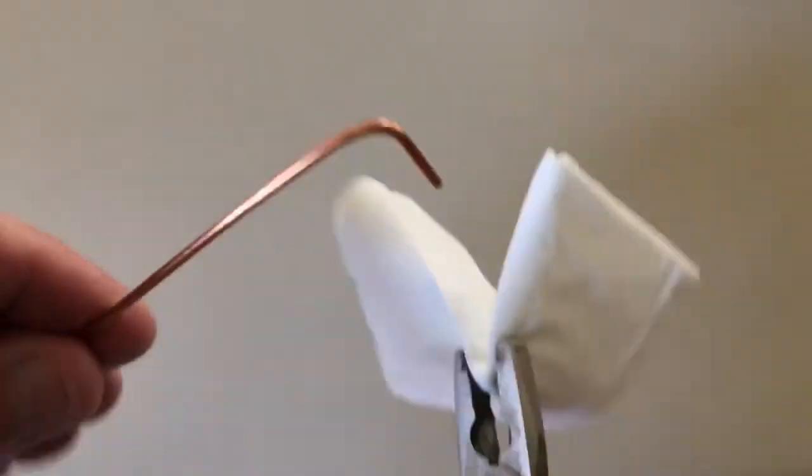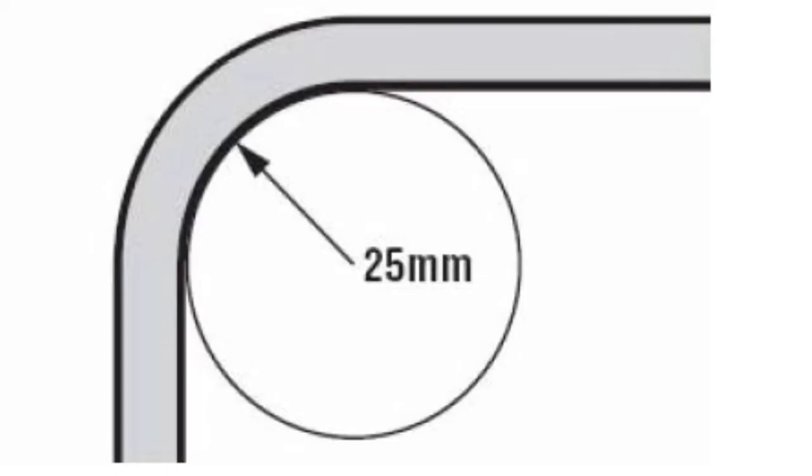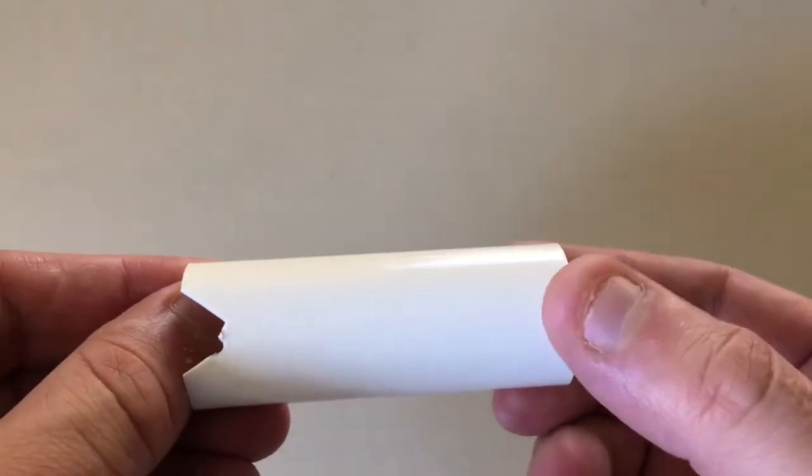This is probably the best way to get your input bend radius for the calculator. Trap 2: the bend radius is usually the radius of the former that you're bending the pipe around, but the online calculator wants the input to include the radius of the pipe as well. So in my case that's 1 extra millimetre.